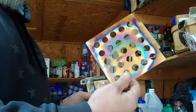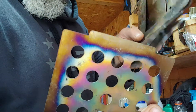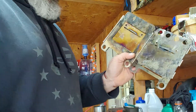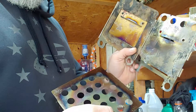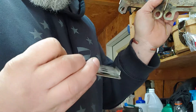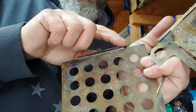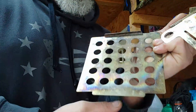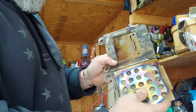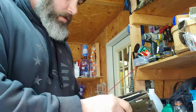Both sides usually look like this — it has this little flat piece right here that goes in these slots right here just like that. What I've done is I've bent one of them 90 degrees, and I took about a sixteenth of an inch off of one side just to shorten it up just a hair. That way it lets it slide just a little to get it out of the way — the hinges — so you can fold it up inside of it.